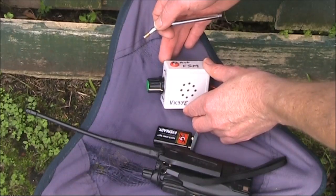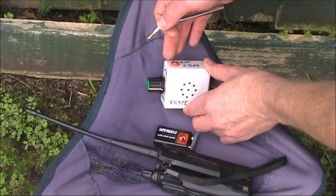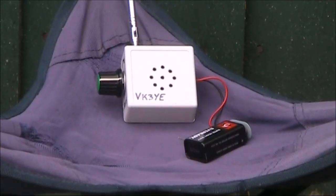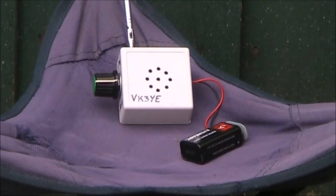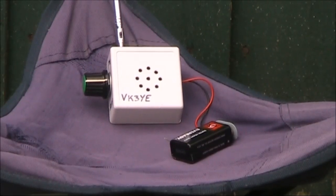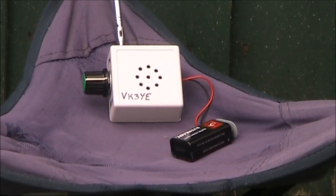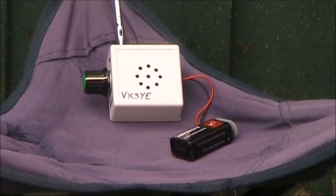For instance, you could use it to help adjust a QRP antenna coupler, where you are adjusting on the basis of field strength. Another possibility is as a CW side tone for a QRP transmitter that doesn't have one — just put its antenna anywhere near where RF is coming out and there should be enough to pick it up.